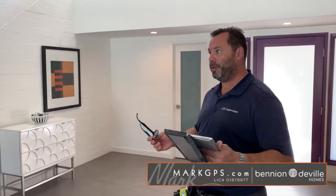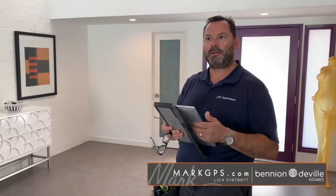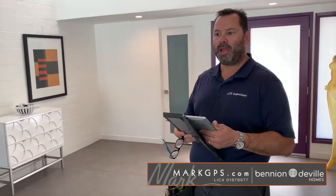The one skylight on the roof above the garage has a cracked outer shell. It's two shells — the outer layer is cracked, which won't get better with time. They can probably replace the outer shell without replacing the whole unit, but if not, it'll continue to crack and damage the inner shell. No water damage was seen. It's above the garage, so I'd go with a roofer rather than a handyman, because they'll be exposing the roof membrane.